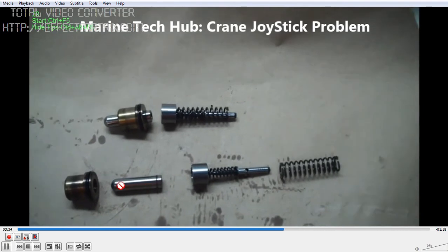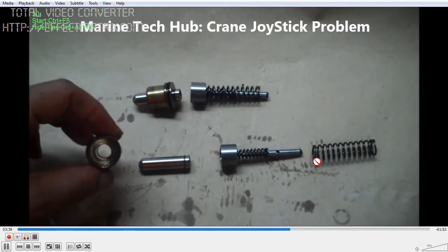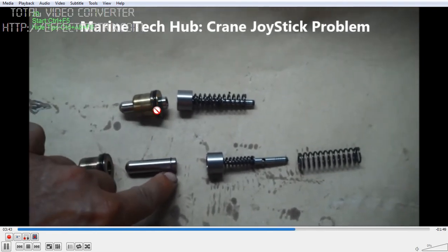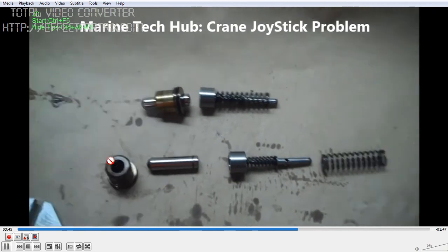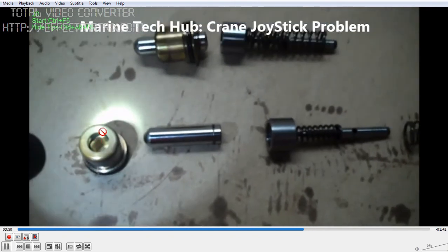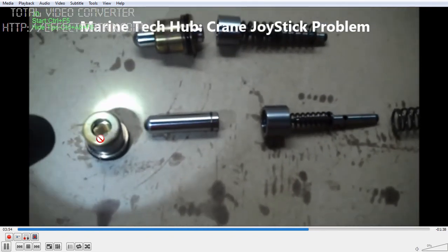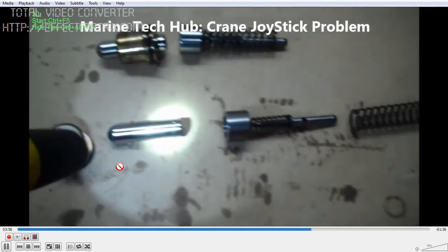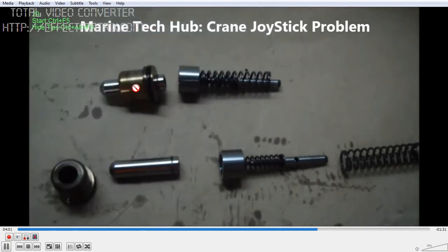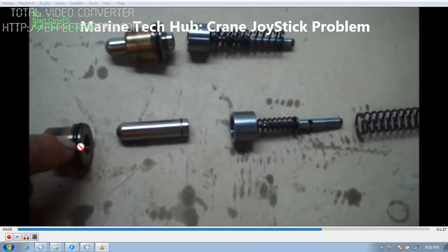What we are doing is changing the o-rings, because the leaking is from the o-ring - the springs are okay. There is an o-ring inside, there is one o-ring here, this is a clip, and there is one more o-ring inside. It is leaking from inside. You can see this o-ring here - we change it with the new o-ring, and we change the outer o-ring also. Once you change all of this, it will not leak.